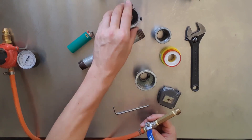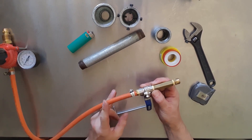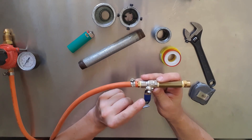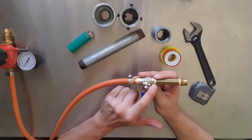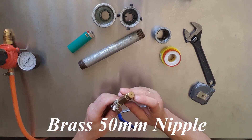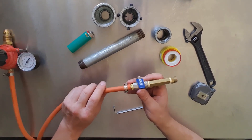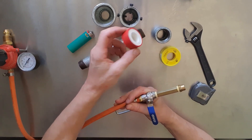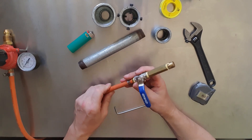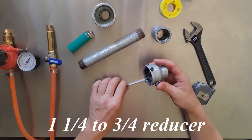On the other end, I've taken this to bits just to explain it. These are all quarter-inch BSP fittings. We've got a proper gas pipe coming in, then a quarter-inch tail male, then a quarter-inch ball valve — female to female — then a quarter-inch nipple which is male to male, and then an end cap with a small hole drilled straight in the middle, one millimeter in diameter. All put together with yellow tape — you can't use PTFE tape with gas, you have to use the yellow stuff — to give a good seal on those fittings.